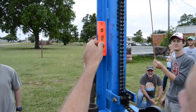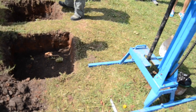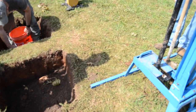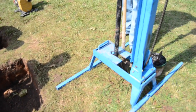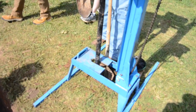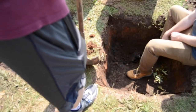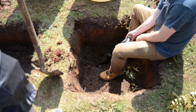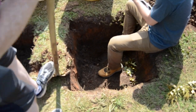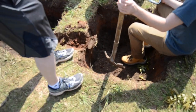Adjust your ropes until your rig is level on two planes. Dig a one foot deep cone shaped hole where you will be drilling. You will dig a one foot deep channel connecting the two pits. This channel allows your water to flow from the first settling pit on the left into the mud pit on the right.